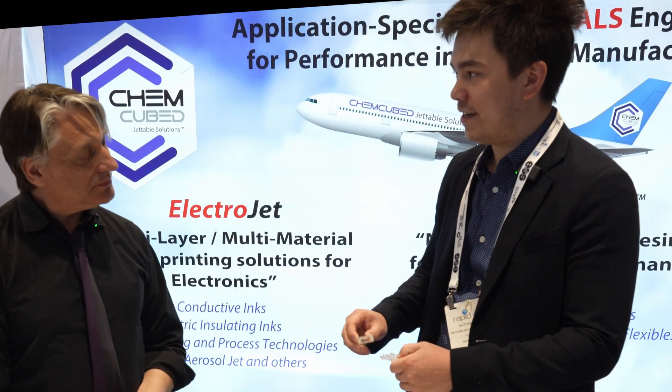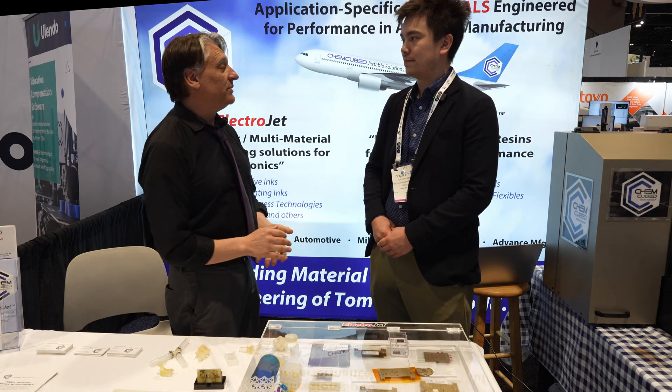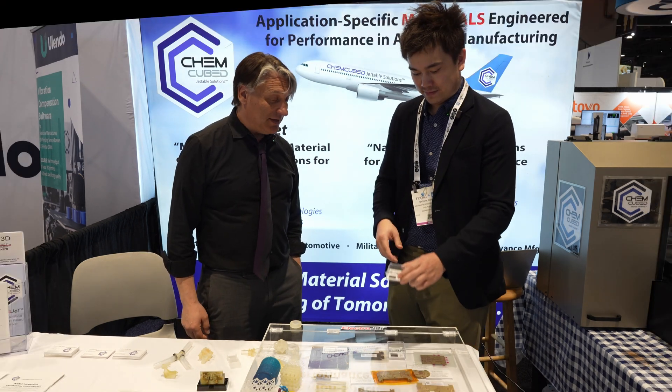Is it mostly the chemistry you have to have a good understanding of? Yes, this is all about chemistry and materials. We work with a lot of OEMs and printer manufacturers. There's another aerosol jet-type system that our inks work in as well — something called IDS — which is an aerosol system that gets very, very fine lines, down to 10 or 20 microns. There are about 10 traces in just over a millimeter of spacing. The aerosol jet can also go on conformal surfaces, where inkjet printing is pretty flat. It's the right tool for the right job, depending on what you want to do.